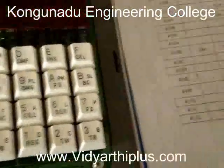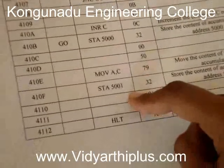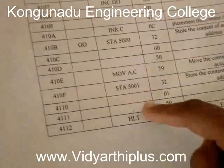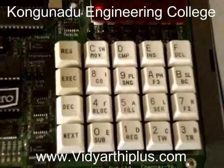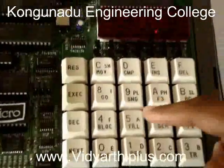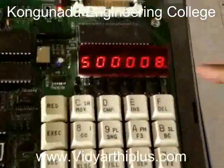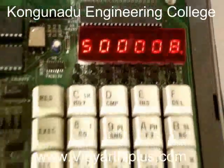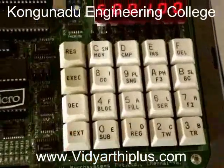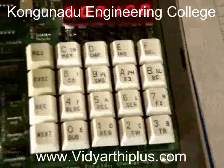To see the output, we go to address location 5000. Then we go to address 5001 to see the carry value. I am resetting and navigating to address location 5000 using sub 5000. Now the output is displaying — 5 plus 3 is equal to 8. The carry value is 00 for this program. So the program is completed successfully.